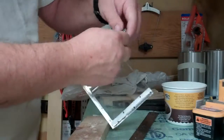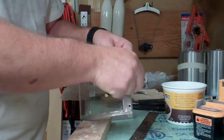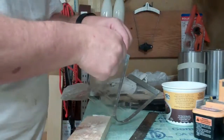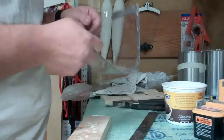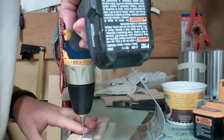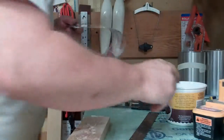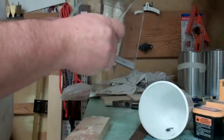So there we have it. Now the last step to this part is to take these bolts out — you can see they tightened up a little bit. We'll take the mounting bolts back out, and then we'll re-drill the 3/32" through there. What you don't want are these bolts going into the rail crooked — they'll bind up and you'll never be able to get the actuators to move your canopy. Better to have a little bit of slop than too tight. So we have those drilled back out now, and the bolts just slip right in.